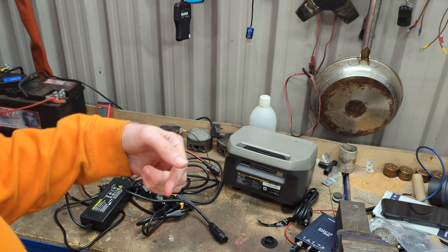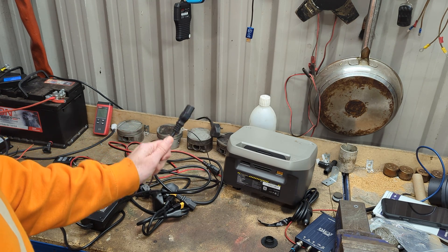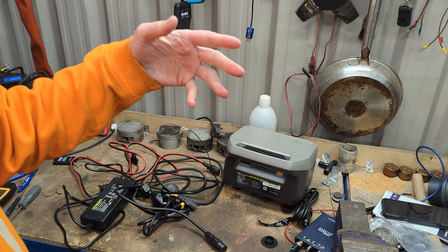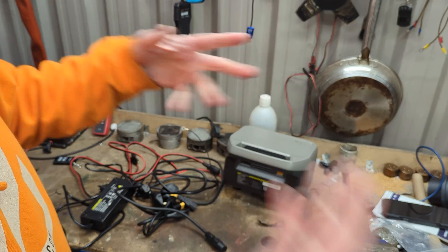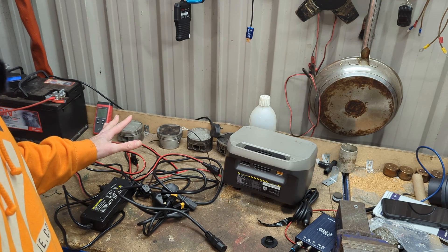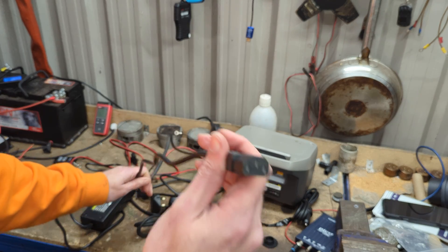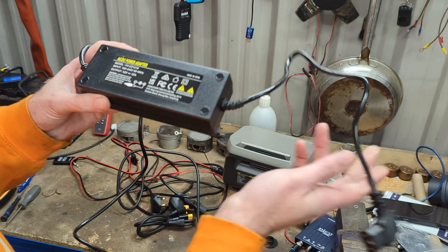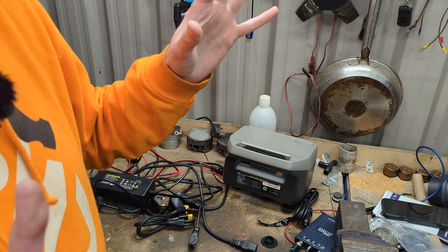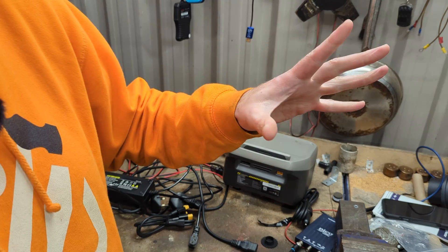You can already go back on my channel and look at videos I've made of the other company using these plugs. I really wish they would stop, and I don't encourage anybody to buy heaters with those plugs in the back — it's dangerous. Even if you buy the heater and give it to someone else who doesn't understand and plugs it into the mains, they could be killed or injured. So please be careful: there are diesel heaters that do correctly accept mains plugs, and others using the same plug for 12 volts only. Please leave any comments or questions below, and as always, thanks for watching.